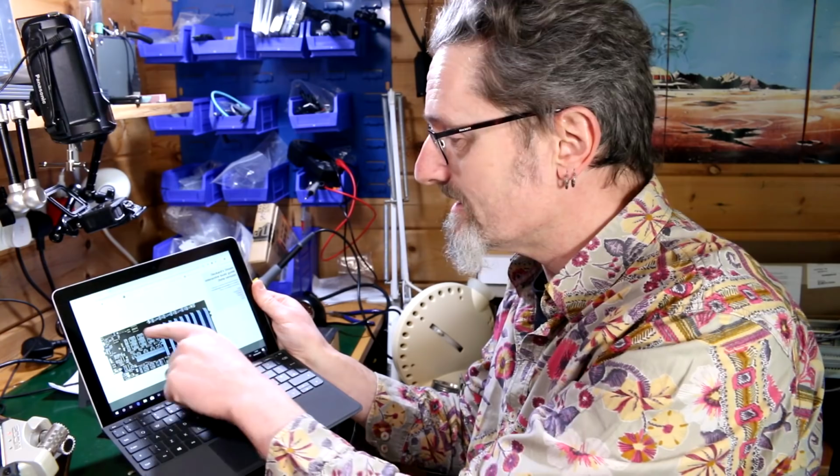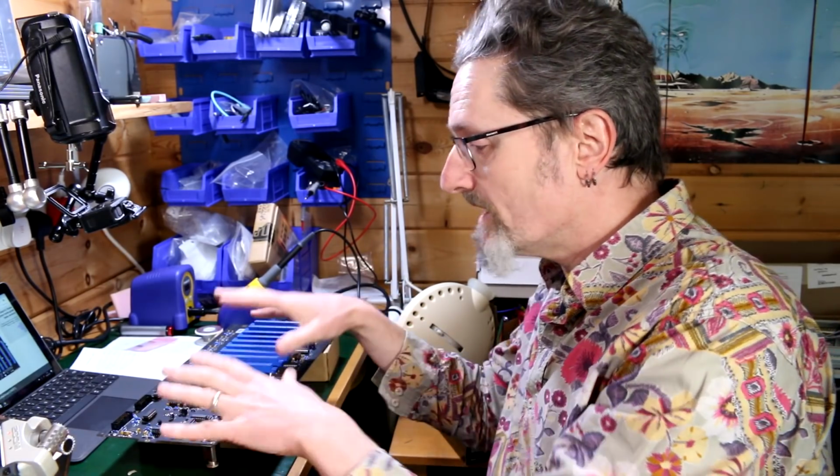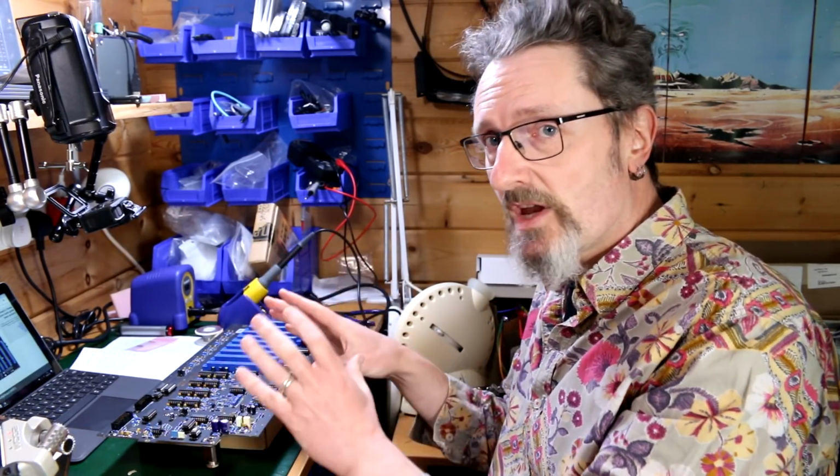And it has these images for all the bits within there. So that is essentially the build guide. To say it's the older version, but it's very, very similar. And if nothing else, it's shown me which bits to do in which order. So do all these resistors, so that you're not in that situation where you put in something that's tall and makes everything else fall out when you're trying to turn that upside down to do some soldering. So it was very helpful in establishing the order that things should go in.